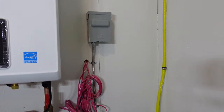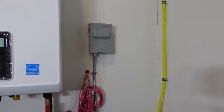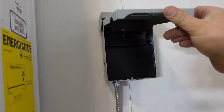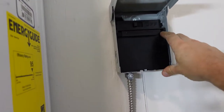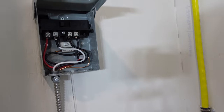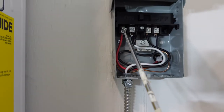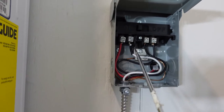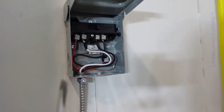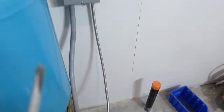Typically these wells are 220 or 240-volt single phase, and they require usually a 12-gauge or 10-gauge wire run from the panel. Inside, this is just a disconnect — simple on and off. If we have a look inside and pop this cover off, you're going to see this one is done with 10-gauge. On the outside of the disconnect, coming from the panel, we have 10-gauge wire which is the line side. On the inside, we have AC90 which is the load side. That AC90 comes down and goes through the pressure switch and then up to the starter.